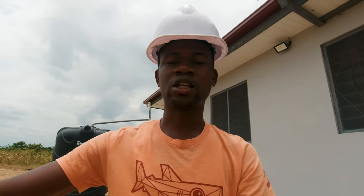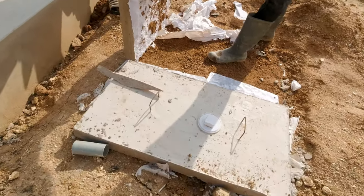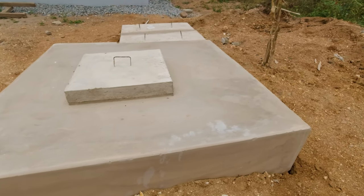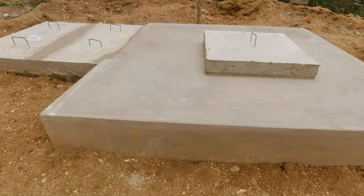We cast the concrete, leaving space in the middle which serves as an entrance to the hole. We did a slab for that — a cover on top — done separately, and after everything dried we placed it on top. After the concrete, we went ahead to plaster the sides and then did screeding on top to create a slight slope, so when it rains on top it doesn't force its way in — it just flows away. Then we placed the cover on top, which has mortar underneath it.